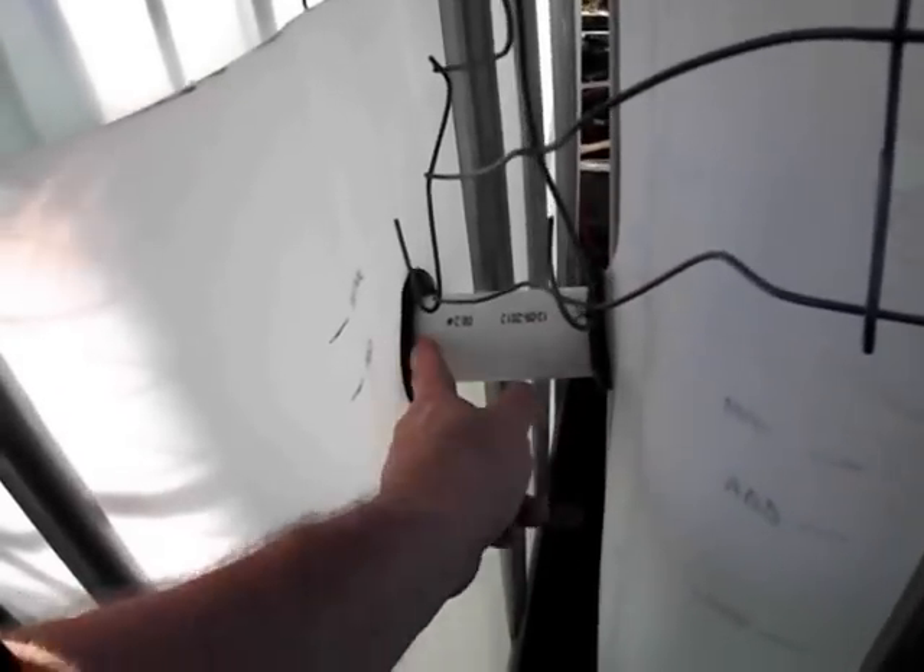When the pipe gets quite large, it's kind of tough getting that PVC pipe inside the Uniseal. So I used some good old plumber's grease. And for this particular application, I had to go in one and through the other, so I simply put a 45-degree bevel with a grinder on the edge of that pipe, and it went in quite nicely.